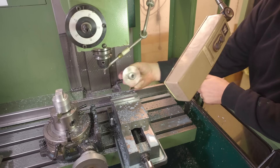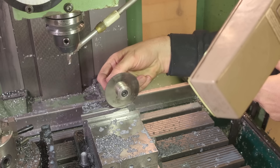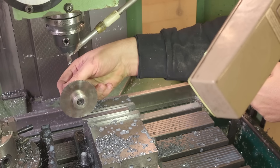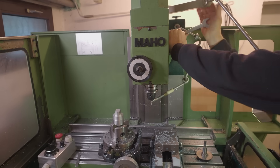For the next operation I'm going to need to use one of these slitting saws, both to relieve the cross at the top and to cut the deep relief groove. To do that I need the vertical head out of the way.